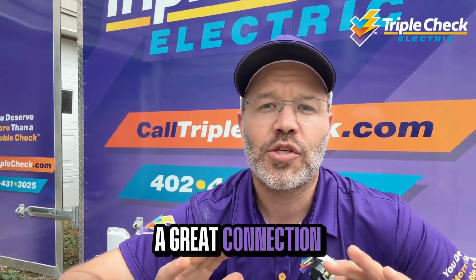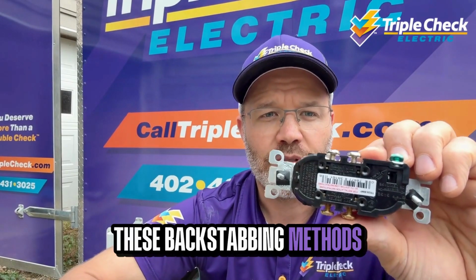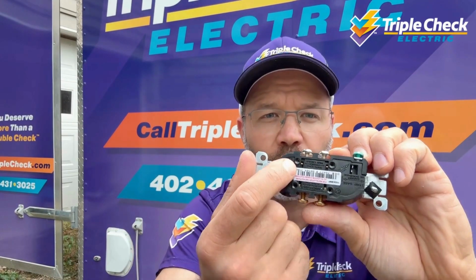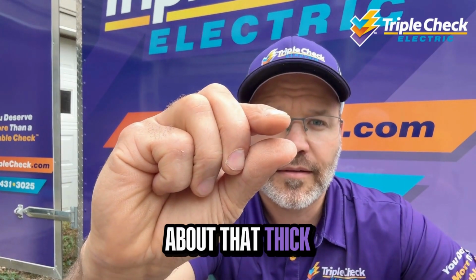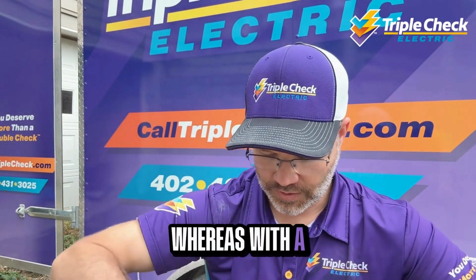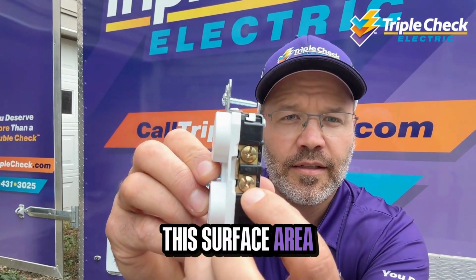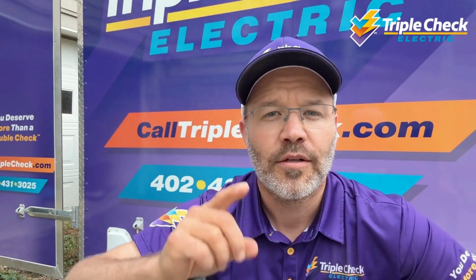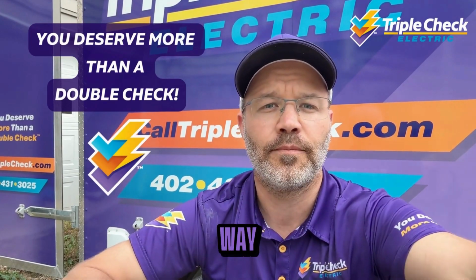A great connection has good surface area. These backstabbing methods, where it pokes in here, it's about that thick. That's what makes contact with the wire. Whereas with a side screw, you're having all this surface area. That's what makes a good connection. Don't hire a backstabber. Hire somebody that cares and does things the right way.